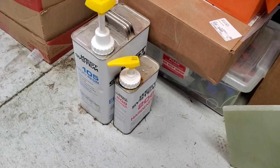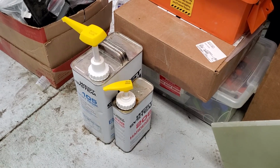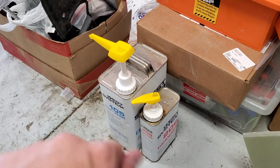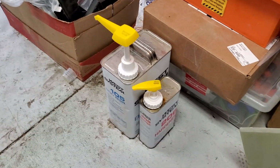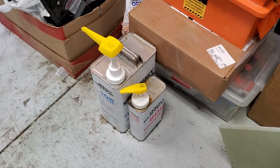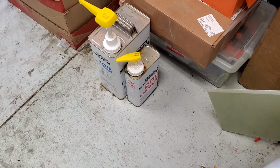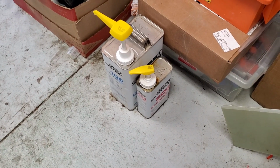As usual, I'll be using West Systems epoxy. I'm going to start with 3 pumps and we'll see if that's enough. I highly recommend when mixing big batches of West Systems like this, mix it in a small container so you can get it well mixed and then pour it out on a paper plate or something similar, because if you keep it contained, especially if it's hot, it'll cure really fast. That happened with my fiberglass iris when I was doing the carbon fiber on the coupler. I went to dip the brush in it and it was hard in like 25 minutes.